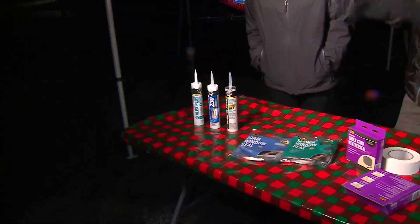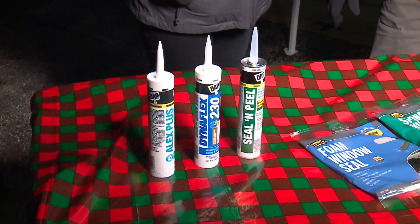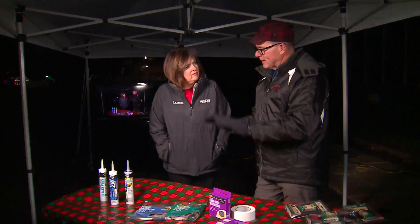This is good because we're talking about cold weather. Look, the reality is that if you can add insulation or replace your windows and doors, all that stuff is great. But what are you going to do right now that doesn't cost a gazillion dollars? Tubes of caulk — any draft in the home where the baseboard meets the floor, if you put your hand down there and you feel the cold air, buy a tube of clear caulking like this. It goes on white. You squirt it in there, use your finger nice and smooth. You'll never see it. If you eliminate the drafts, it will make your house so much warmer.